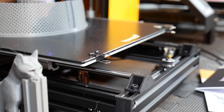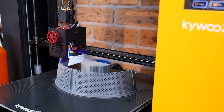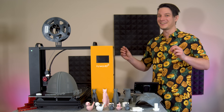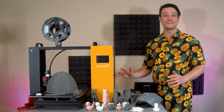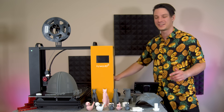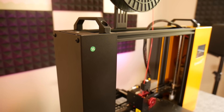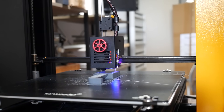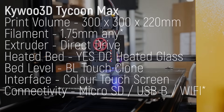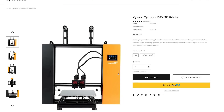Instead they've gone with linear rods for the Y and Z axes, with dual lead screws synced by a belt running under the printer, and a nice linear rail for X with accurate smooth motion. The choice not to use rollers in a design made from V-slot is really odd — eight millimeter hardened rods have quite a bit of deflection across such a long unsupported distance, and this design honestly makes little sense for them. I would have just used the V-slot with rollers. Overall the frame combined with sheet steel makes for an incredibly rigid design. The Tycoon Max sports a print volume of 300 by 300 by 220mm in Z, with a single direct drive extruder, and they also offer an IDEX version for dual color or material printing, which looks pretty interesting.